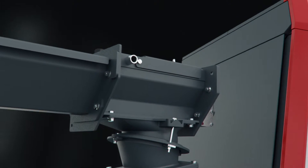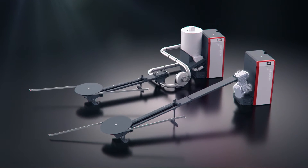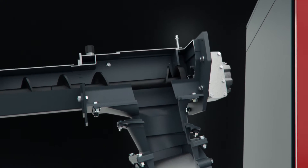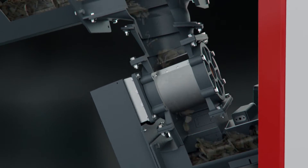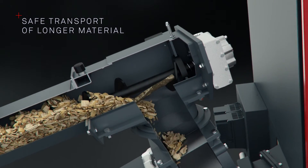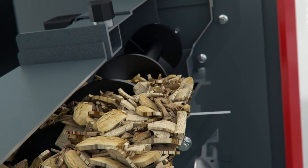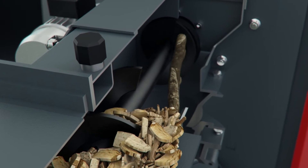In systems with a direct woodchip feed, the fuel extraction head fulfills two functions. Firstly, the auger directs material into the head from the safety auger channel, and secondly, it forms the transition to the smart two-chamber rotary feeder. At the end of the auger channel is a spiral running in the opposite direction. This anti-blocking system, ABS for short, always directs longer material down into the drop shaft, preventing the auger from blocking and ensuring safe transport of woodchip into the rotary feeder.